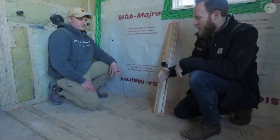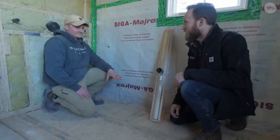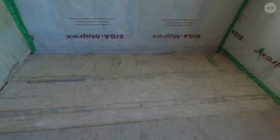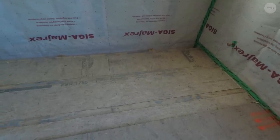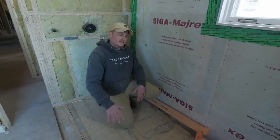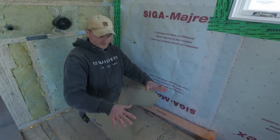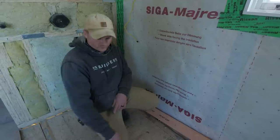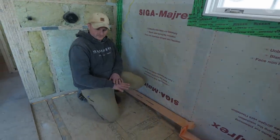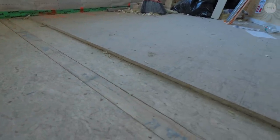You essentially had to cut this plywood out and rip up the glue — that Advantech stuff that was nasty to remove. We lay out where the shower is going to be, snap a line, make a nice straight cut, peel back the subfloor, expose the i-joist, then glue and screw blocking to either side. We cut our pieces of subfloor down. The top chord of the i-joist is an inch and a half so we have two layers of three-quarter plywood to flush everything out. We're only dealing with three feet, which allows us to get that quarter-inch-per-foot drain slope.